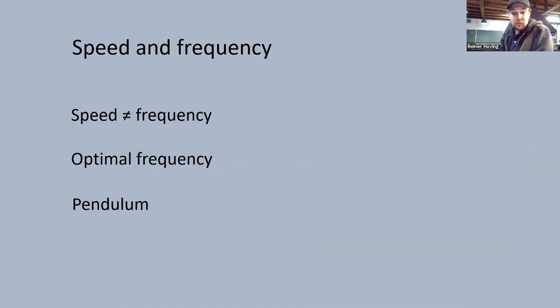Now we come to the part I actually want to talk about: speed and frequency. Speed is a big factor in exerting energy, but speed isn't the same as frequency. Some students think that hitting fast is the way to go, but frequency is a very important and distinct part of forging. I like to look at the trajectory of a hammer blow as if it were a pendulum. When you take a weight on a piece of string and fix the other end, it becomes a pendulum, and that setup has a fixed frequency when given a swing.